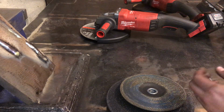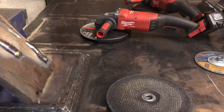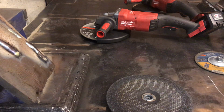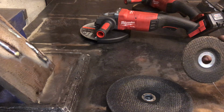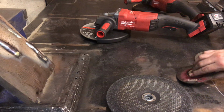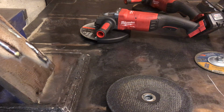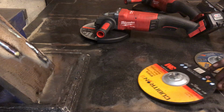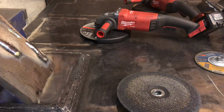And a handy thing is, if you are trying to make something flat, make the surface that you're working on flat, it is much easier to do with a big grinding wheel than a small grinding wheel. And hopefully that's kind of self-explanatory. You can imagine, even if you have this at a pretty shallow angle, it'd be pretty easy to dig a trench in something, and just based on the fact that it's a larger wheel will help you with that, or if it's a cut-off wheel and you're trying to make a straight cut or whatever the case is.